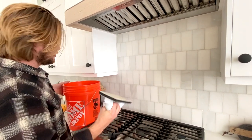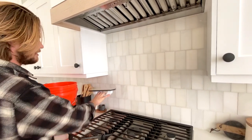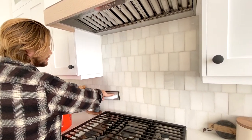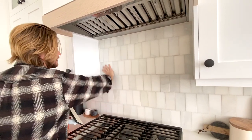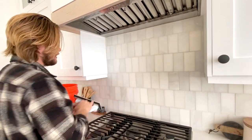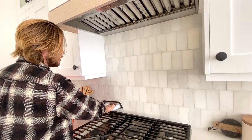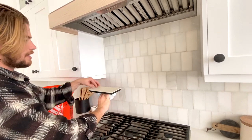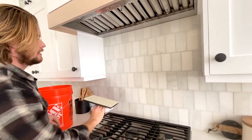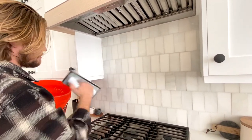You're just going to take your float, get a bunch of grout on it, start at the bottom, and smooth it across. You're trying to cover the entire surface — even the tiles. It'll look like you're destroying your tiles but you want a nice layer across the entire thing. Then go back through with the rubber edge, put a little more pressure at a sharp angle, and squeegee it off the tile. It'll reveal the tile and leave the grout in the cracks, and then you can use what you just squeegeed off for your next line. Just keep adding more grout from the bucket as you go.